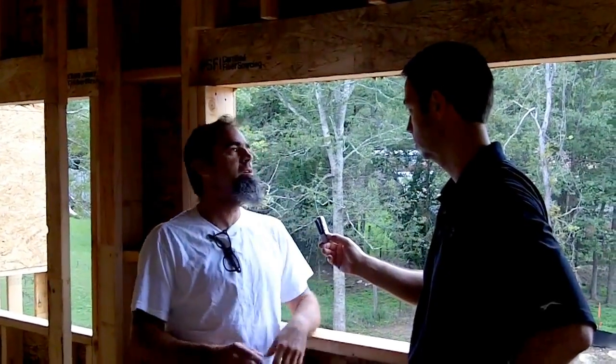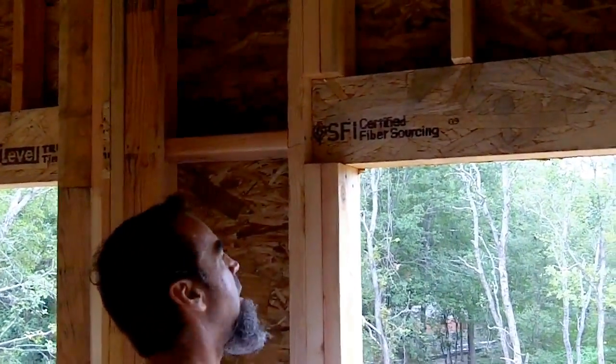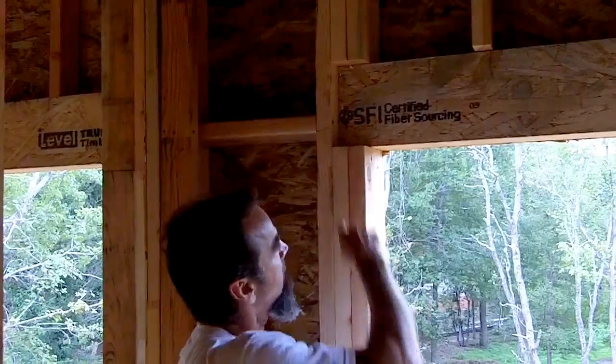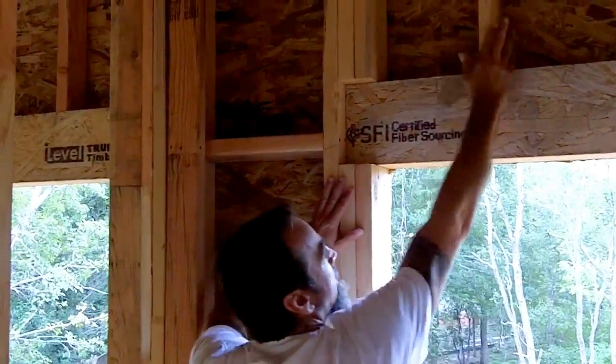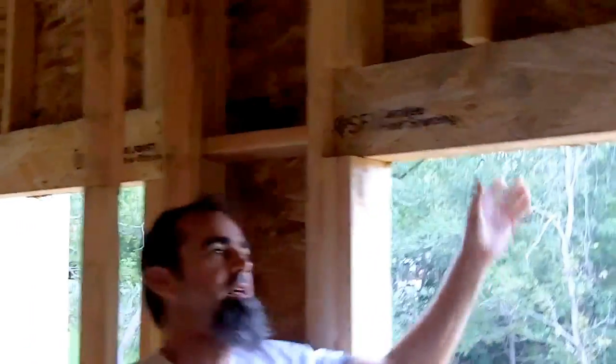Well, again, to minimize the cracking and the shrinkage that we always have with that, guys, always take your sheathing, and when you install it from the outside, you never want to run your sheet over a door or a window running straight through. It's faster, totally, but it's always better to go ahead and notch your piece out. And what that does is it ties your kings, your cripples, your header, and your above cripple material together, and it locks it in much better.